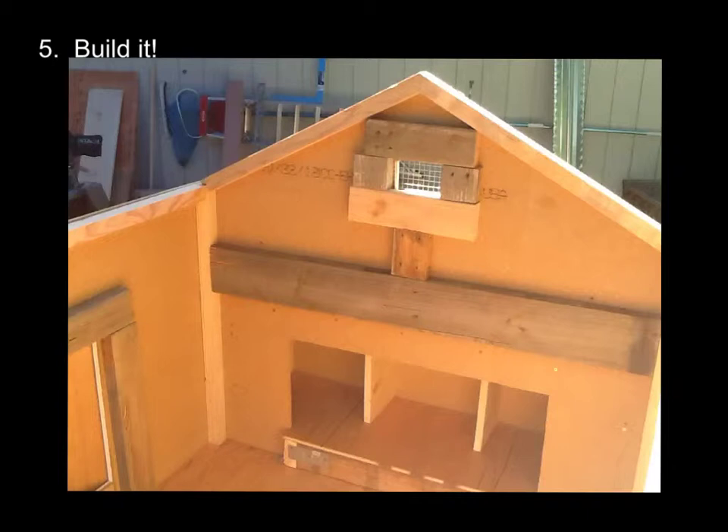Inside view of the nesting boxes. This big 2x6 I put on there to help support the hinge, so the screws are coming through the back and going into the 2x6. And then I went ahead and stacked these up so that my A-frame is not just pinching on itself, but it's also resting on wood that's going all the way, transferring its weight all the way to the bottom. And as you can see, I've got three nesting boxes — the plans called for four, but I wanted to give them a little more room. Here you can see there's the four-inch rise; this is where I filled it up all with shavings.